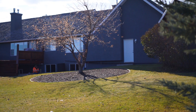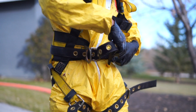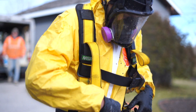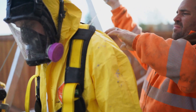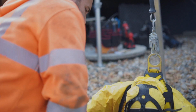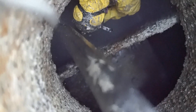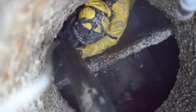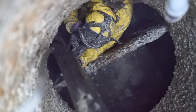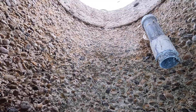We didn't want to do that, so what we decided to try this time is a tank entry. We brought the vacuum truck in, went down inside the tank after it was all cleaned out with all the confined entry equipment. We pressure washed the inside of the tank, and right now we've got an LB White heater on it drying everything out so that we can apply a two-part epoxy on the inside. That's going to slow down the progression of the corrosion in the concrete and hopefully prolong the life of the tank.